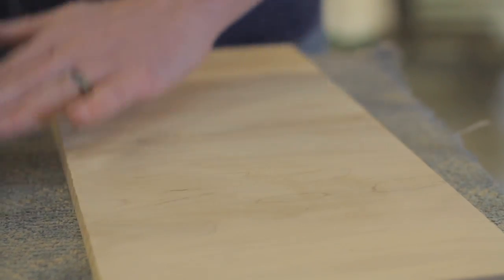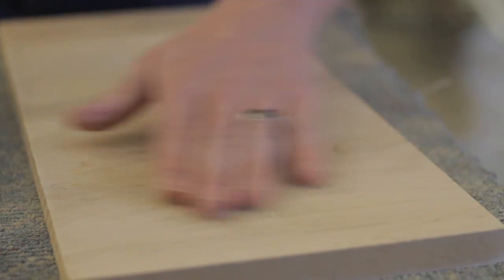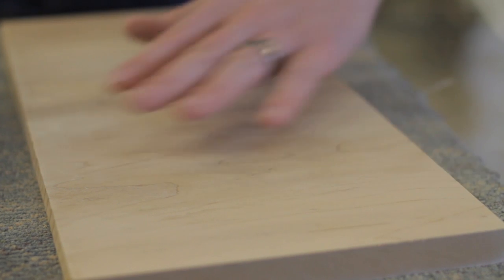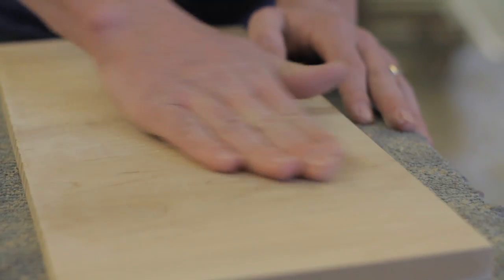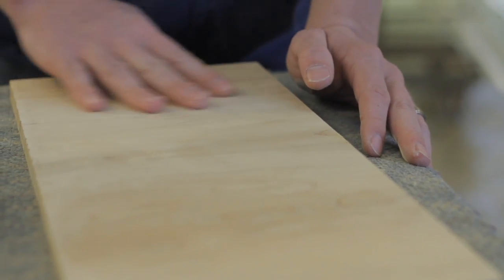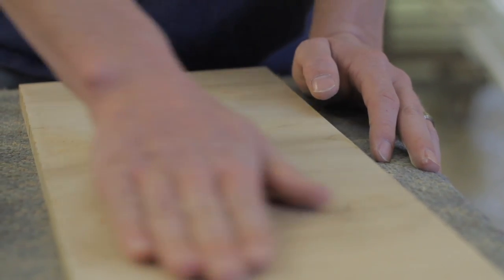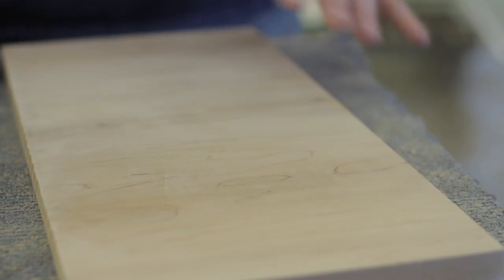You can see how it starts to peel off the material, which it should, just a little bit, and sand it down and kind of flake off in real fine dust. It should be smooth by the time you're finished. If you feel an area next to it and it's still rough, this area over here is still very rough. This area down here is nice and smooth like it should be. That would be ready to be refinished or recoated or repaired.